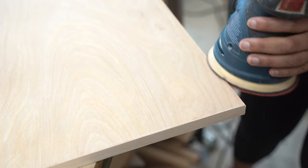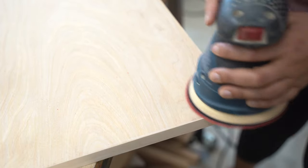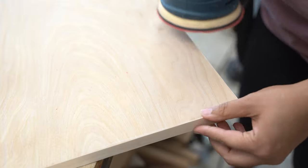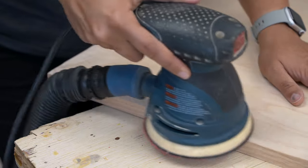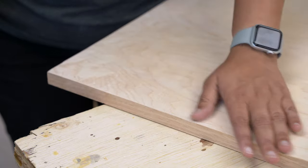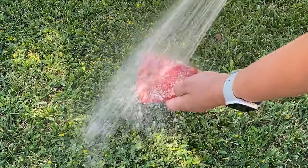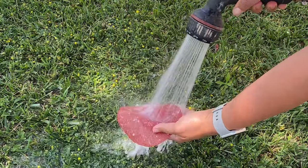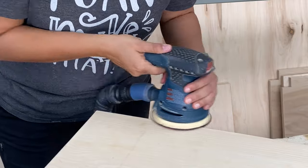You do need to be careful about a few things — make sure not to over-sand because plywood has a really thin top veneer and you do not want to go through it. Use a medium speed and go in the direction of the edge, and you should be able to get a nice clean finished look. The glue residue can be a little harsh on sandpaper so you might go through it faster. Recently I found sand net sanding sheets and blocks — these are easily washable, so you can scrub away the glue residue, dry the sheets, and reuse them.